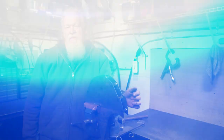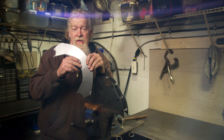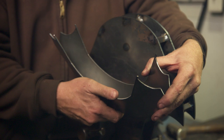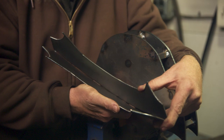We have a fair number of different pieces that we've cut out that are essentially templates. I cut these out to match the drawing of the nose. Some of these templates have to be cut differently for the bend allowance as we create a 3D form. We're only coming out about two inches on this piece, so I was able to just take these over the anvil and bend them. They're 12-gauge steel, so they've got a fair amount of weight to them. Even with the edges touching now, I've got basically the distance I need to create this nose cap. I'm going to get this together, weld it up, and this will get us moving forward on our structure.